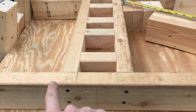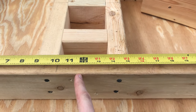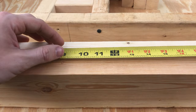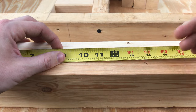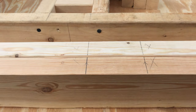Once you get everything cut out, measure and mark where the two 17-inch pieces connect to the 24-inch piece. If you start at 12 and go an inch and three-quarter back, you'd be at 10 and a quarter. If you go an inch and three-quarter forward, it'd be 13 and three-quarter. On the two new pieces, measure 10 and a quarter, then 13 and three-quarter. Get your speed square and draw your two lines. I put an X on the outside of the line so I don't accidentally connect the piece on the wrong side.